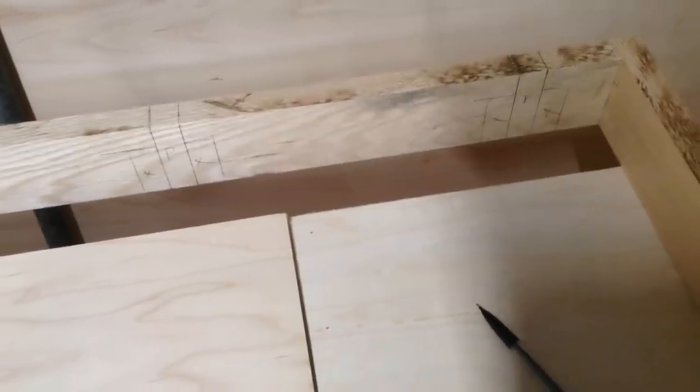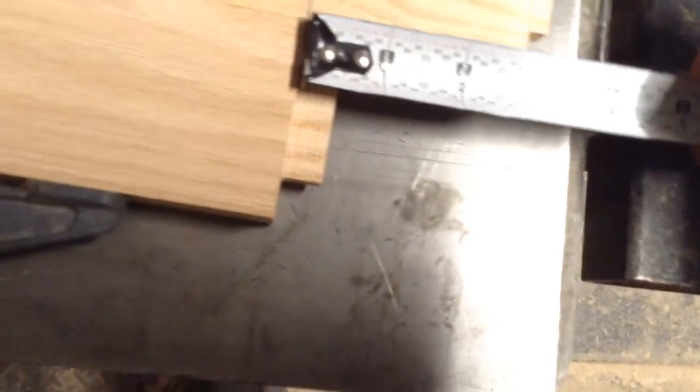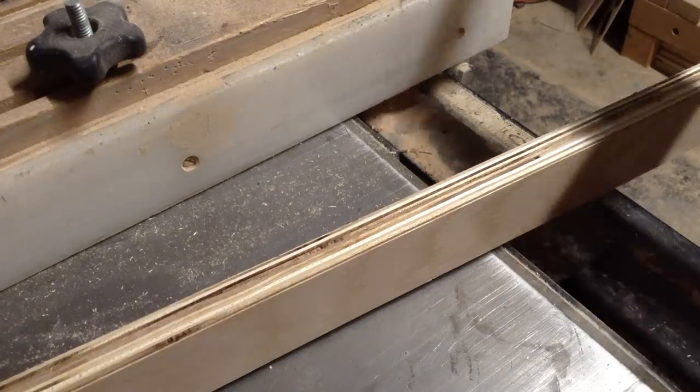In order to put these partitions in, I'm going to be bracketing them with some smaller sheets of plywood so they stand vertically — a great way to strengthen the frame and keep those partitions vertical. I'm going to be doing that with dados. You can see I drew out all the dados on the back — the partitions will be for the edges as well as where all the drawer boxes are going to go. I'm doing through dados, and I have the front and back pieces clamped together so they're identical. I'm making sure I have the same measurement on each side, which is three inches, so when I cut all these dados it's three inches on both sides. When I take this apart and reassemble it front to back, the dados are perfect.